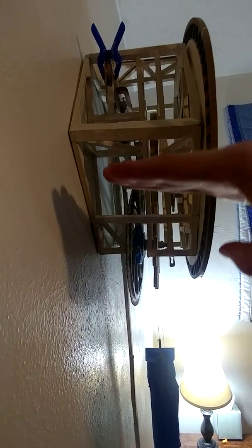Well, if I had to do this clock again, which I may someday, I would put them in at a slope upwards. That way when the frame inevitably sags, they'll flatten out level. So if you're just starting on a Peace Tower clock, put your gears in with a slant upwards towards the front. That way when the frame sags, and it will, your gears line up.